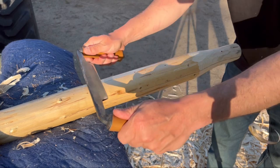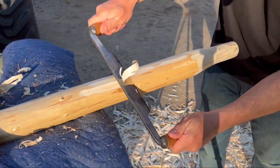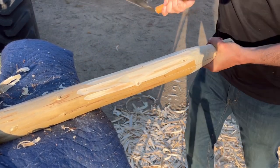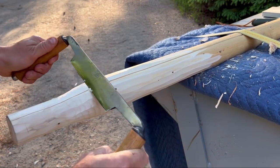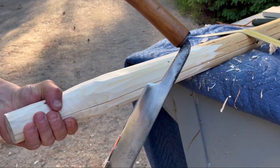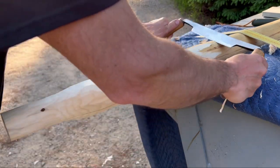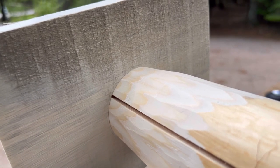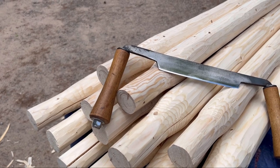That stuff will be good fire starter for the fire pit. For the peel on the remaining logs, I'm just taking the draw knife and taking some nice light strokes — not going too deep, just taking that outer layer off. This gives it a real nice look. This balsam fir peels real nice — pretty wood. Look at that once you peel it. It's got a nice rustic look — call it 'el rustico.' Not a bad fit for just eyeballing it. Finished product: 12 hand-peeled tenons with the draw knife.